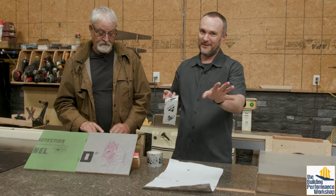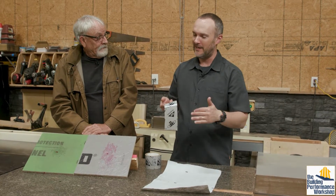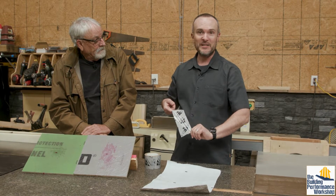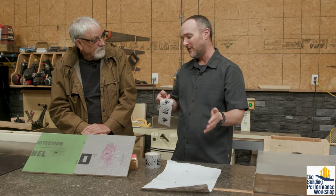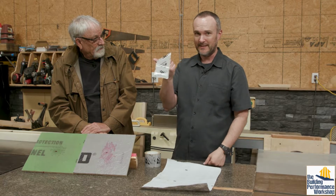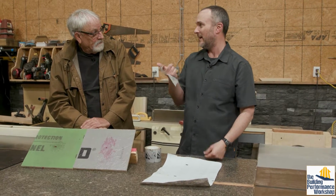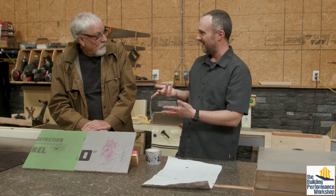Just for anybody who's watching this who's not a super nerd this far into the video, you're a super nerd now that you made it here. But blower door tightness is what we're talking about. So passive house, 0.6, we beat that by 50% with this stuff. A lot of people didn't think that was possible. We wanted to tell the story of why, like that it's a system, not a product, right? Right. So it's how you do it.